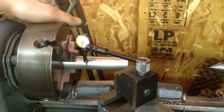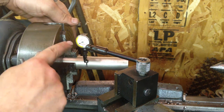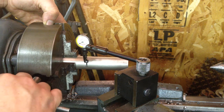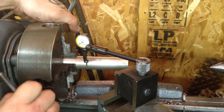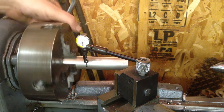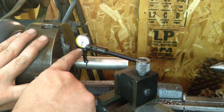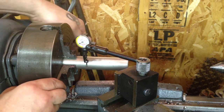I'm going to advance forward again until I get something — going a little more. At the most dramatic point we're at about five, and the opposite side is a little above zero. Five and zero — that means I go back to five and tighten on the front side. So I'll loosen the back a little bit, then tighten the front about the same amount. I did it too much and went the wrong way, so I go back to five and tighten from the front. Now we're at five and two. That means I need to loosen the back side again, and I'll just keep doing this until I get an even reading.